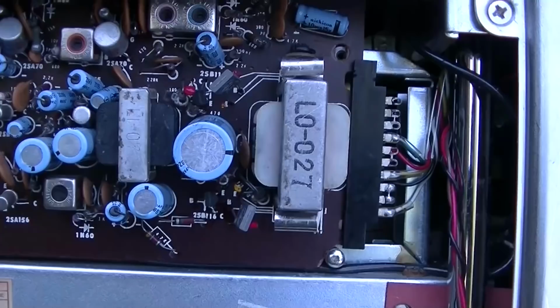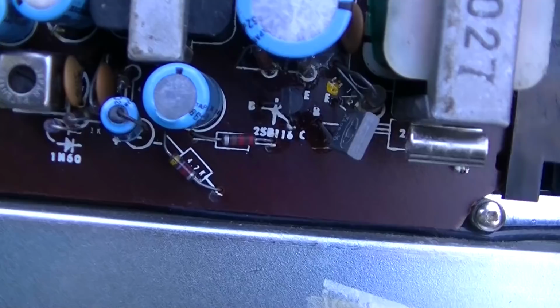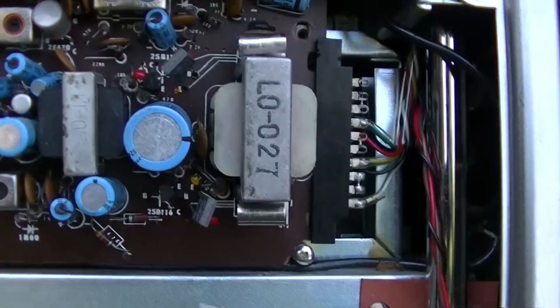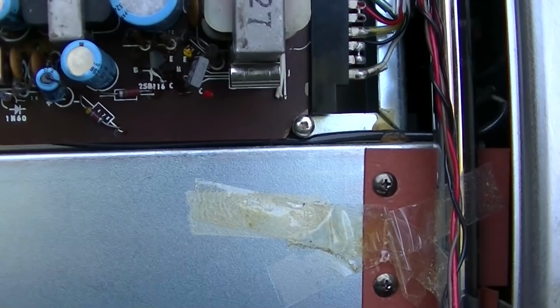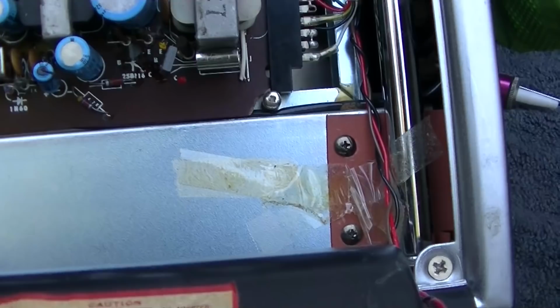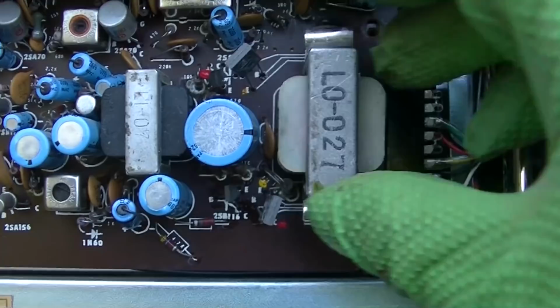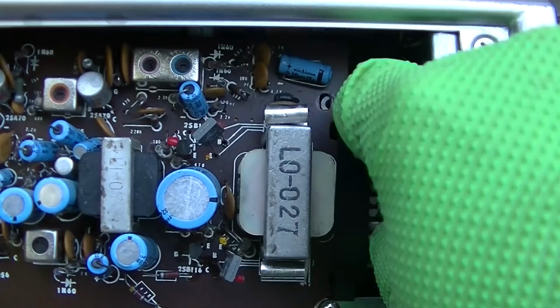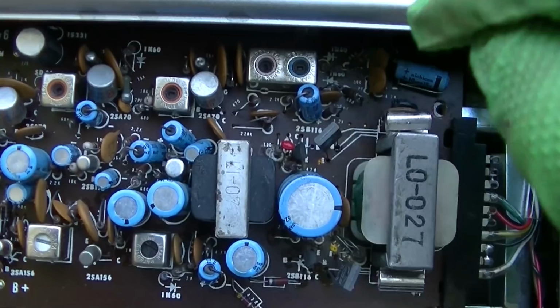All right, we have our silicon transistors installed. And I got to say, with the markings on the board and this little guy here, it sure makes getting the leads right. And we're powered up. And we're right at 20 milliamps with no sound. I mean, no sound at all. We have a cracked something here. Seems like something is not making contact. Okay, let me see what cracked.